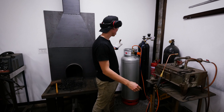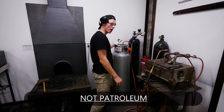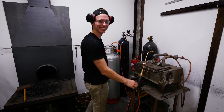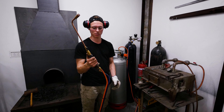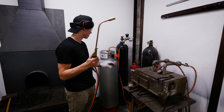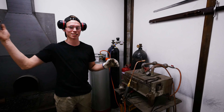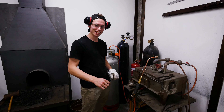Speaking of heat, the fuel we're using is propane with an oxidizer — pure oxygen — in this oxy-propane torch. What's important to keep in mind when you're using something like this with high-pressurized explosive gases is fire extinguishers, flashback arresters, ducting in, ducting out. Always got to keep safety in mind, and with that said let's get back to what we're doing.